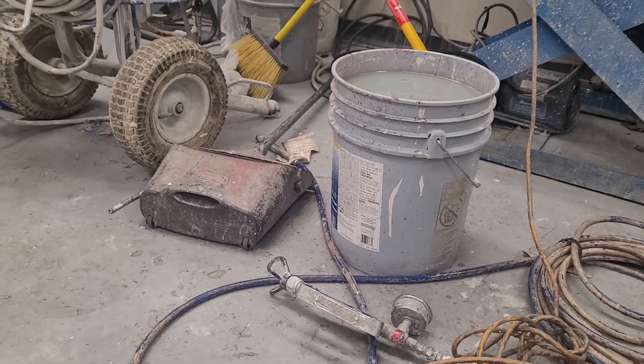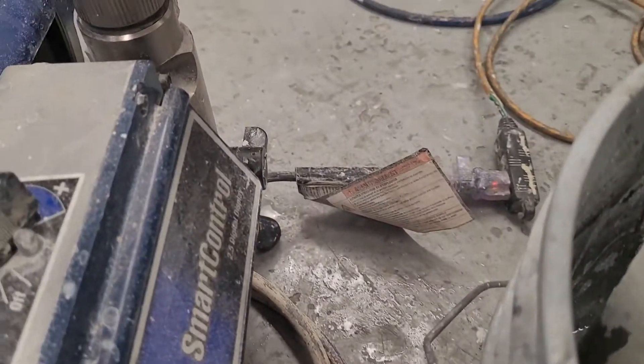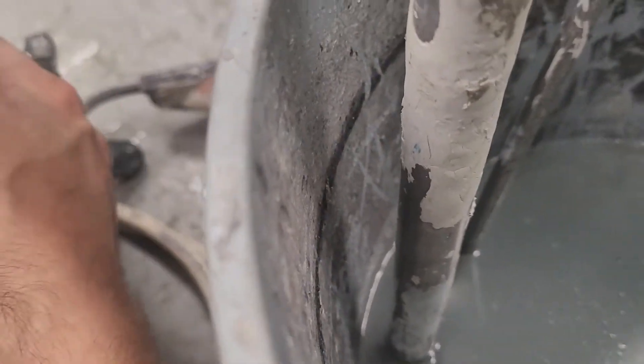I've got air in the pump now. I'm going to let go of the trigger, put it back down — even though it's down, it's not picking up any pressure. Because the paint is supposed to be pushing on the ball to close the valve.